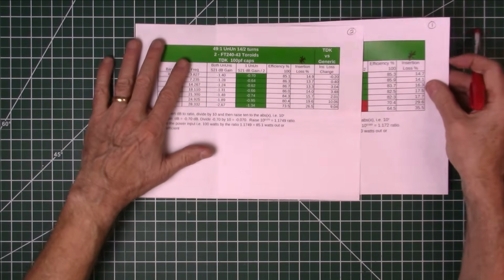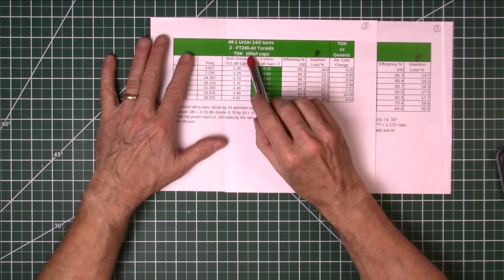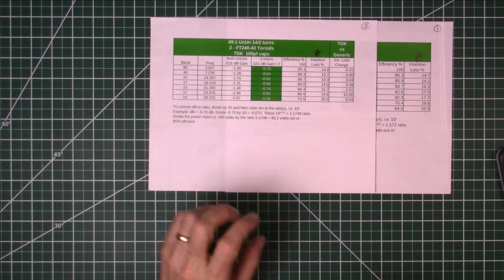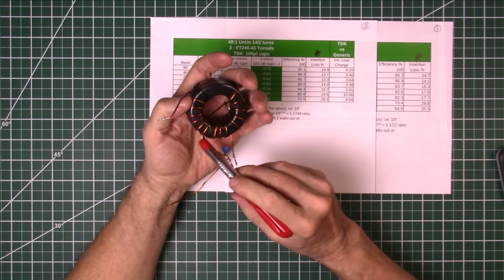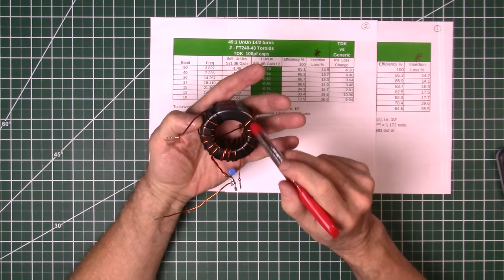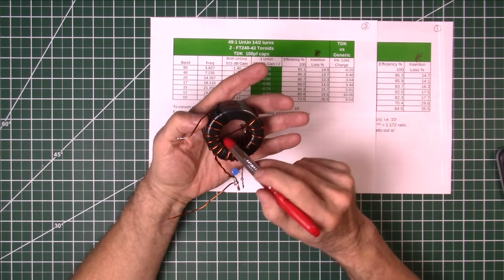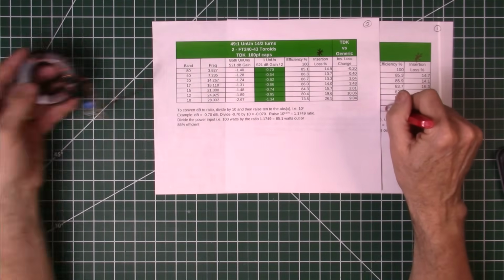Well, then wanted to find out, you know, these both were wound with the 14 total turns, where the first two turns were the bifilar twist, which look like this. This is the bifilar twist, where we got the first two turns twisted together as primary and secondary. And then we got the other 5 turns for the 7 on this side, and then the other 7 on this side with the crossover. This is the way that these two transformers were wound.